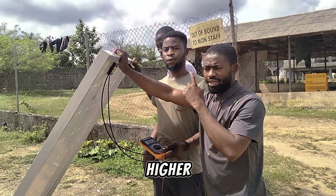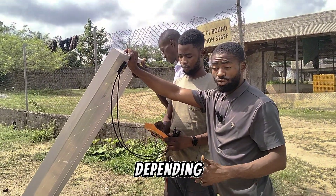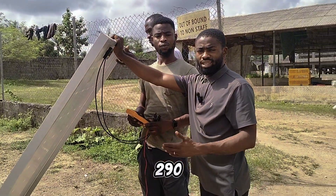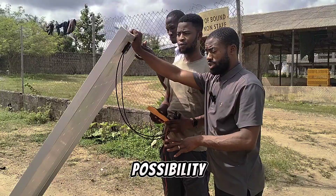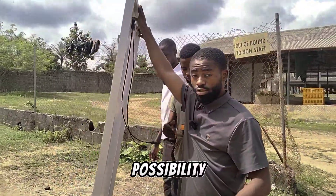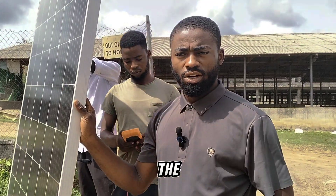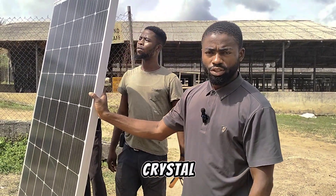Though if the sun is higher, it might be able to generate up to 350 or 380 watts depending on the weather condition. With dull weather we generated 107 watts, and when the sun came up we generated around 292 watts. So the higher the intensity of the sun, there are possibilities this solar panel will generate up to that 11 amps. I'm not saying it will definitely reach 11 amps, but it may generate close to that, because the voltage has already exceeded what is written on the sticker.